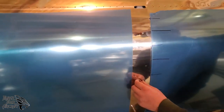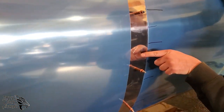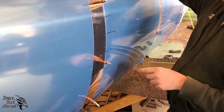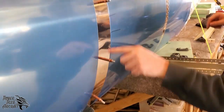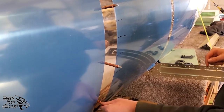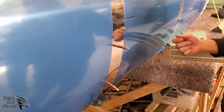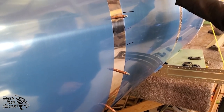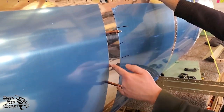What we did do is we decided it was easier to see the holes inside out from the front side of the bulkhead instead of looking down in the cockpit. So we did re-drill these three holes here from the front side of bulkhead 2. Again, inside out, we verified that nothing had moved. Bulkhead 2 is still perfectly square. What we're going to do now is that both sides are clecoed,